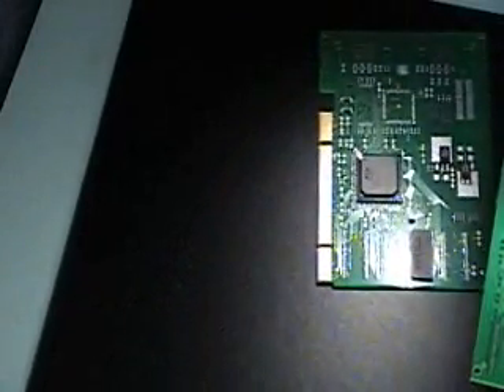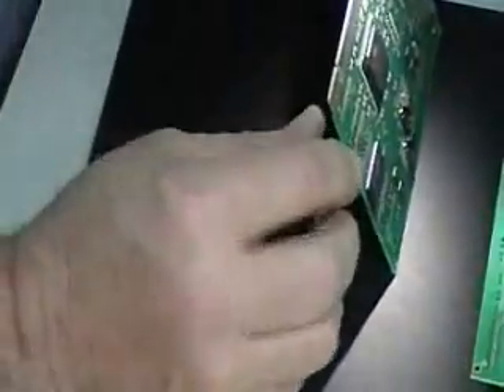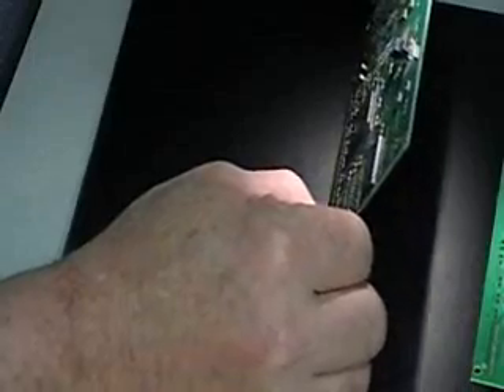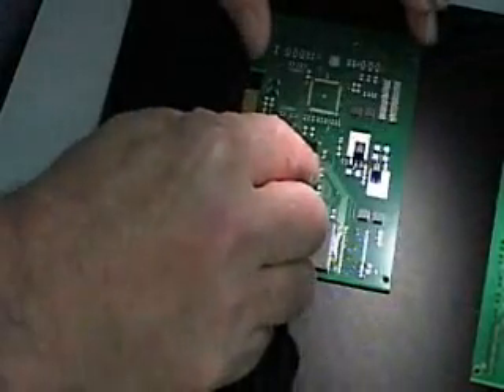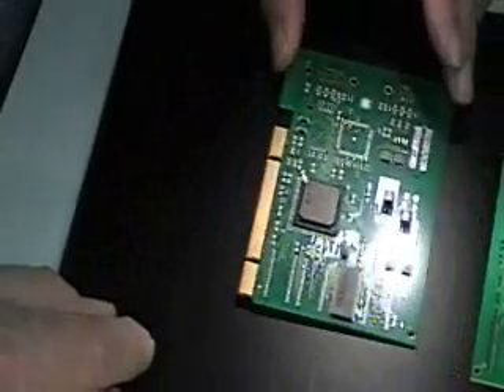Now I'm going to use a microscope to look at these. You'll notice they all stay there — they're not going anywhere. I'm going to look at these BGA balls to make sure they're lined up. If they're lined up on the outside, then they're lined up on the inside. That looks pretty good — I'm happy with that. Even if you're just about 20–25% on, it'll normally pull the chip right in. That board's ready for reflow.